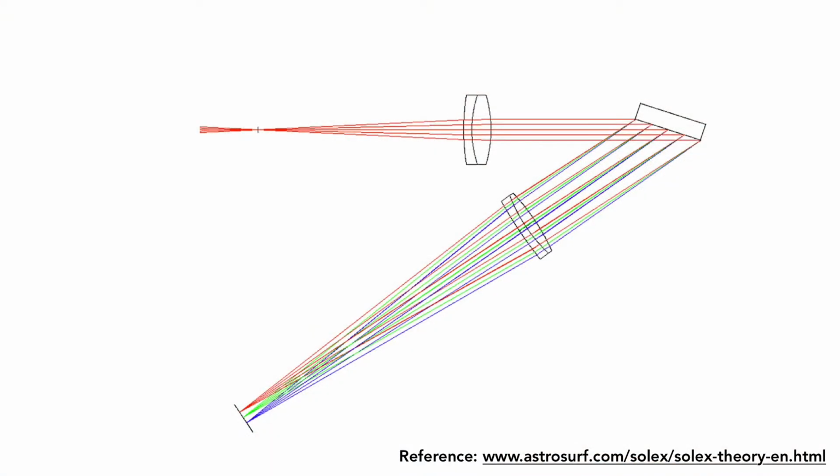This is a fairly classical spectrograph. Let me show you how it works using this diagram. The light from the target, focused by the telescope, comes from the left side of this diagram. The first optical component that it encounters is the slit, which is a very narrow opening, only a few microns wide and a few millimeters long. The telescope must be focused so that the slit is precisely positioned at the focal plane.